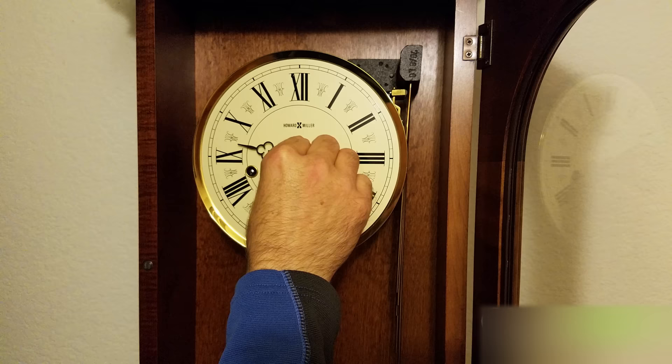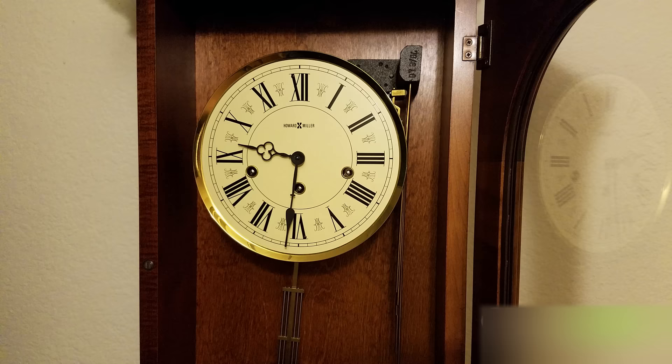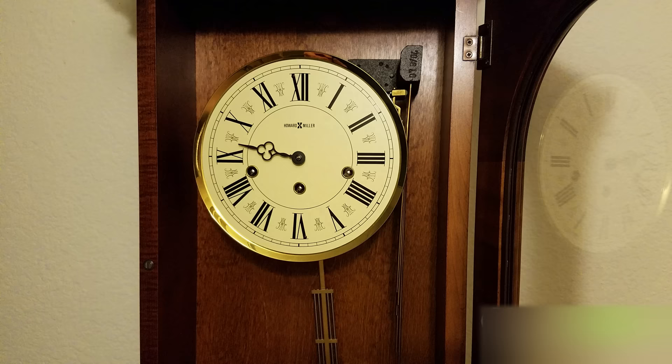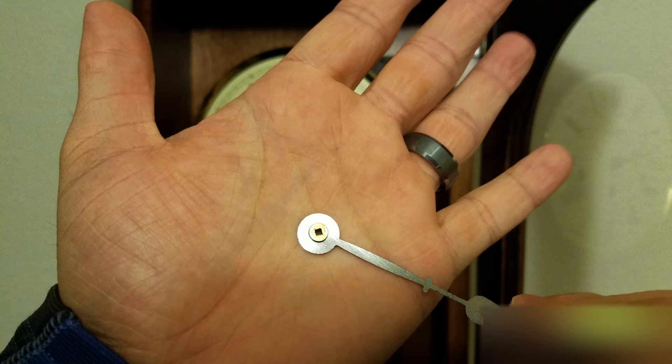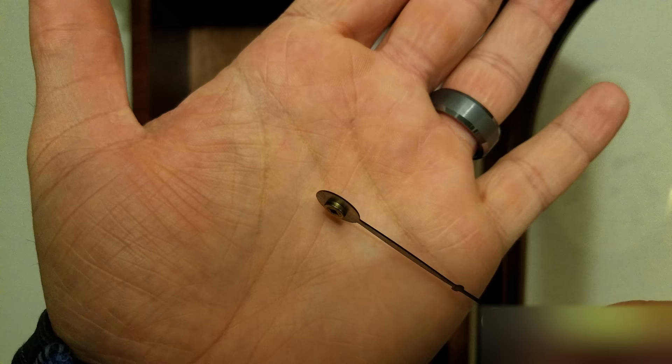What you want to do is take this center nut off. In some clocks it's going to be a little bit stiff and you just want to use some pliers — just wiggle this off. The hand is a little bit bent. You can see here — this is the front of the hand that you'll see when you're staring at the clock on a daily basis. Turn it around and you'll see that little gold piece, it's almost like a washer, like a pressure nut, and there's just enough room on the other side to grab it with some needle nose pliers.